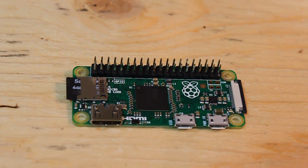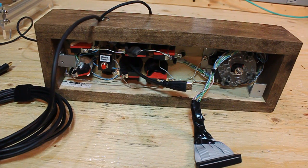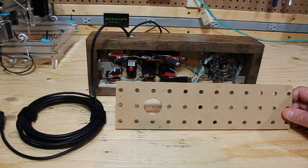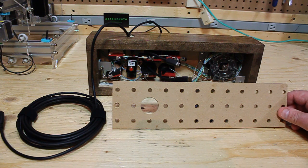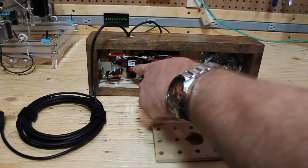You may have seen other builds where the Pi Zero has been crammed into a Game Boy. However, I wanted to build one with more accessible materials such as wood. On the bottom I'm using a small piece of quarter-inch thick pegboard which protects the circuitry and provides some ventilation. I also drilled a 1-inch hole so I can access the shutdown button here.